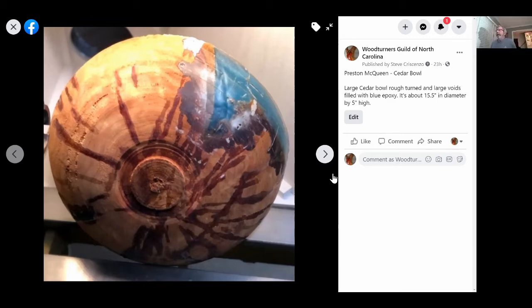Well, coring, and it's not quite done, but you can core acrylic and wood pieces. But it does get grabby. You need to be really careful with it. I'll show those pieces next. So I took three cores out of a bowl about this size. It actually had a little more resin in it than this one. The difference between the way it cuts on the wood and on the resin is you just have to sharpen those tips. I sharpened it twice in the course of one core in order to get it to keep cutting, but it does get grabby. It's also an advantage of the one-way system with that chisel cut on it; it cuts better than the blunt on some of the other coring systems. That point on the one-way will help you out there. Anyway, I'll show you next month.